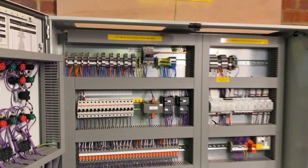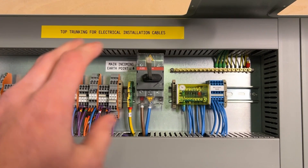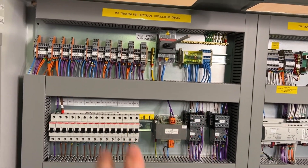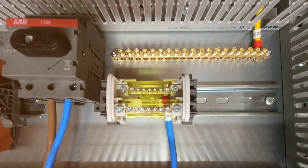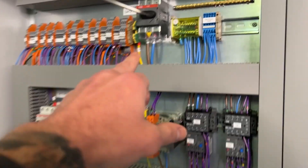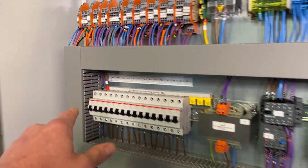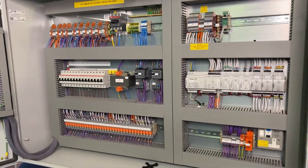This is an industrial control panel and I'm going to show you how to wire the power and how it's distributed across this panel — starting from the incoming main isolator, distributed across the neutral blocks, the earth or protective earth, the L1 live 230 volts, and how that's distributed across the MCBs and across the rest of the panel.